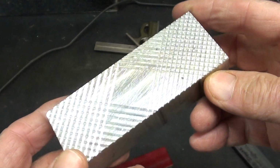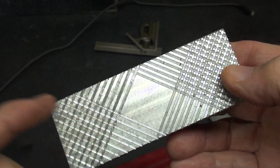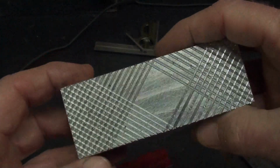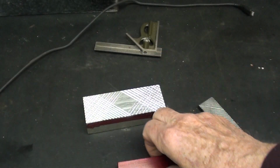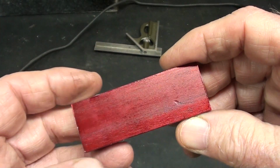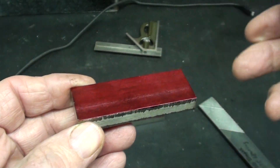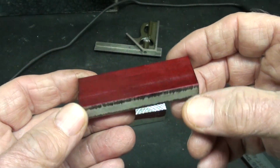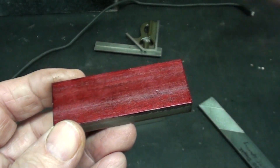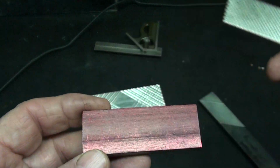Yesterday I did a rehearsal and I used aluminum and I made serrations here with several different spacings and depths just as a sample to see what I want to actually do. But today I'm going to take this 3/8 cold drawn steel, and I put some dye on here so that it'll show up as I make the first few cuts. I'm going to run through this real fast. You don't want to see the whole thing, but I think it is an interesting and useful process. It can be decorative even if it's not an actual jaw on a vise.